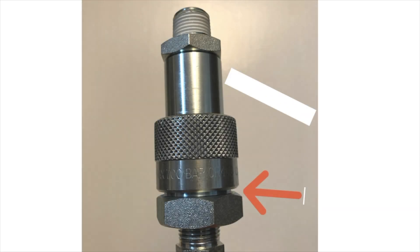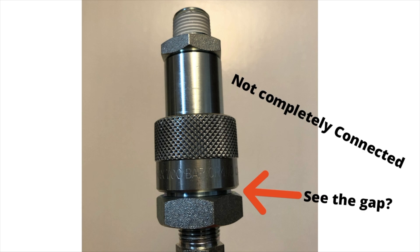What exactly does this tool do? It relieves hydraulic back pressure by safely bleeding off locked-up couplers. A locked-up coupler happens when a coupler set comes unthreaded while under pressure, allowing the ball or cone valve to seat in either coupler, and pressure builds up because the oil can't flow through the coupler anymore.